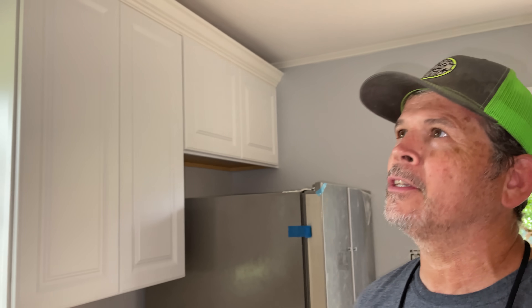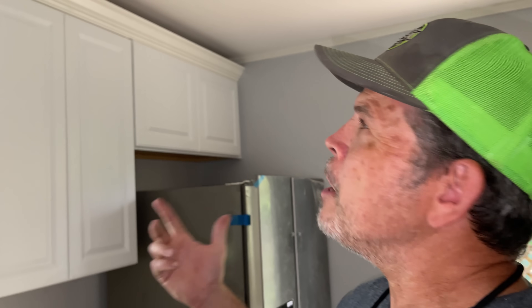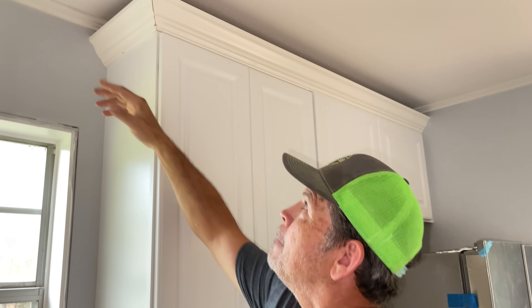Remember guys, this is some cheap MDF that's primed from the home center, so a little paint on those miters. I'm really liking how this face frame corner goes straight up into that miter — that looks really slick. We haven't seen that on a lot of our projects. And that's the first thing I'm going to look for in people's kitchens from now on. We are loving that — it came off without a hitch. So that tells us that is beginner friendly. A beginner can do that, and a pro can do that, and you're going to get basically the same results. If you can cut crown molding — that's the hardest part of this whole thing — it's super easy to build that nailer, attach the crown to it, put the whole thing up there as one unit, put those screws in, and you're done. I 100% recommend this method. If you have any questions, ask them down below. Give us your own tips and tricks. Subscribe if you haven't already — that would mean the world to us, and we'll see you on our next video.